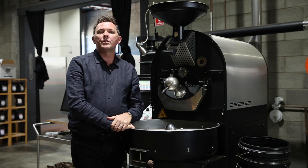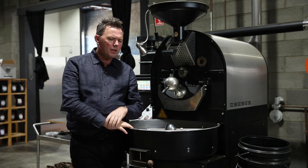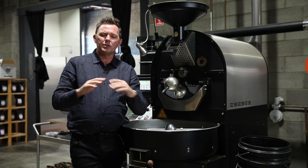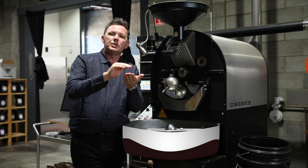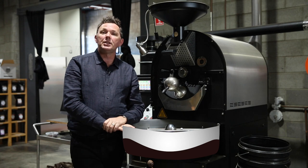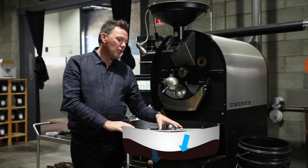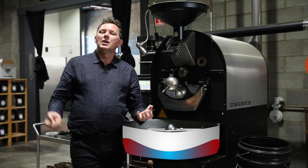We've been trying to get our cooling down to three minutes, and we've done that by having a variable speed controller on the agitation. One of the things I noticed is that the faster you speed the coffee up, it's similar to the principle of a centrifuge — we get a very deep bed of coffee on the outside of the cooling tray and it comes down to the middle which is quite thin. We have a blower sitting on the bottom, and air will find the least resistance area, pulling from the middle first. So effectively we're cooling the coffee quickly in the middle of the cooling tray, but on the outside it's taking a little slower because there's less velocity or suction being applied.